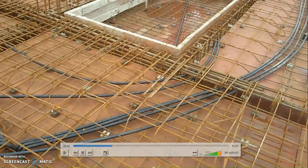This is an RCC slab, this is an RCC beam, these are the top bars of the beam, these are the stirrups, this is the main beam, this is the column. These bars are called bent up bars — the main bar is coming and then it is bent up. This is a bent up bar.